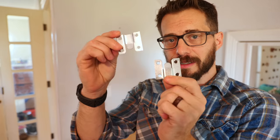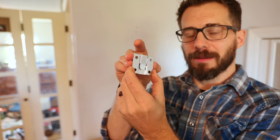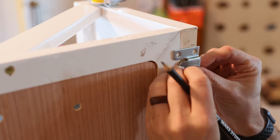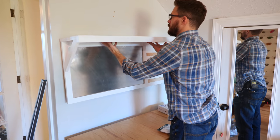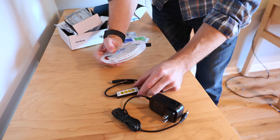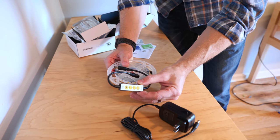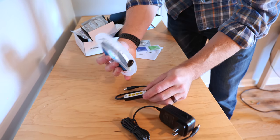The last thing is to hang this on the wall, and I want it to be nice and sturdy. I found these flush mounting brackets — it's two pieces. One goes in a stud on the wall and the other goes on the back of the piece, and they slide right together. It's a nice metal-on-metal connection and they're nice and sturdy, so I'm going to go ahead and put these on the back of the shelf. I've already got two of these on the wall and we'll mount it. I bought a really inexpensive kit of LED tape to put up here so they have a desk light. I didn't get the ones with a remote control because those are not individually addressable — one remote would control all three, and since I've got three boys who will probably mess with each other, they each are going to have their own local control. We're just going to stick these up there and plug them in.